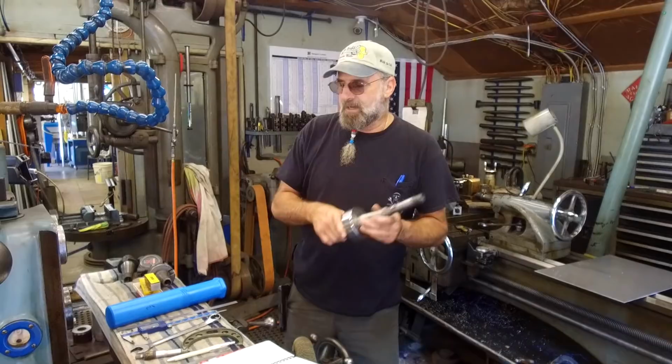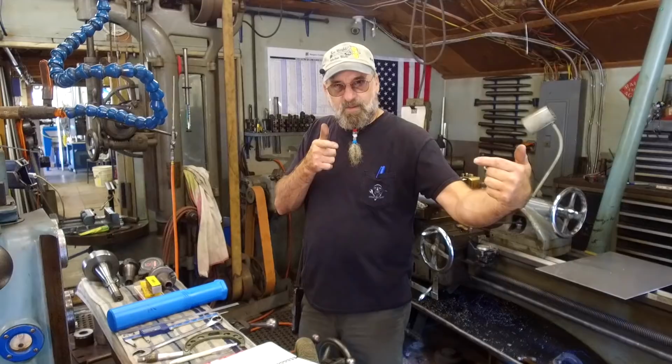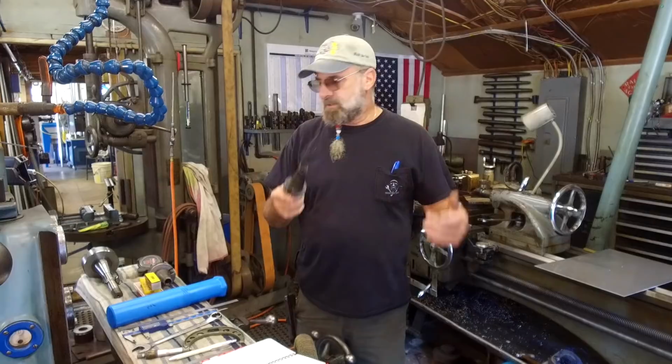And this is ready to go in the lathe. But we have a dummy over there, and we're going to be dialing it in momentarily and setting up our two centers that hold the mandrel perfectly true in line with the lathe. All right, we have samples, and we have plenty of samples. We have a lot of tooling for the K&T. But you want to know the technical dimensions for the machine tapers.